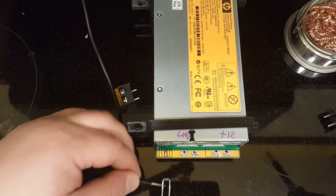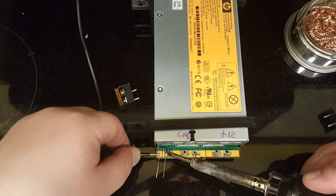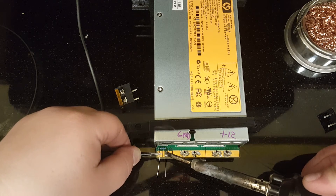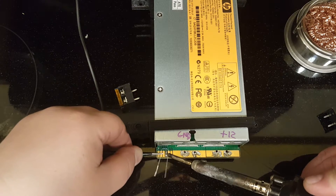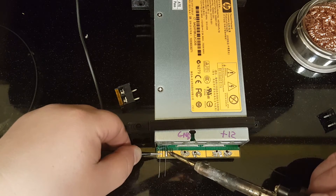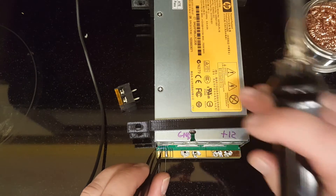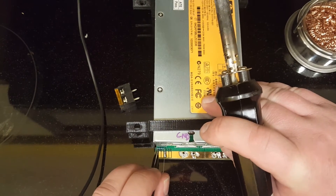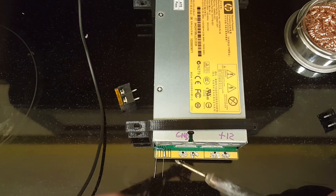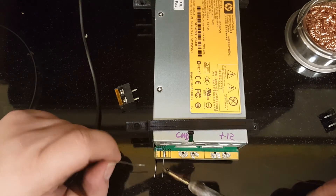I'm going to place this resistor where I like it right here, make sure that it doesn't short out to any other pads, and arrange the other pin. I'll move the resistor out a little bit, apply tin, and we should be good with the resistor.